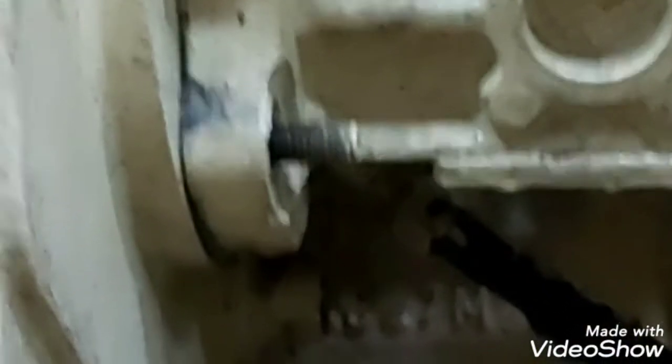This is the locking nut, and this is the fuel injection pump. The purpose of this video is to show you how to remove the injection pump when there is no key in the gear. There is a tool below the injection pump — pull it out. There is one hole in the flywheel. You have to turn the engine manually and insert the tool so that it matches in the flywheel.